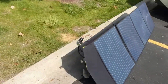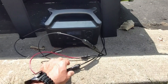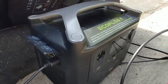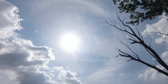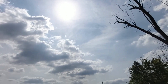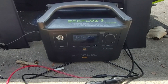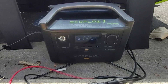I went ahead and plugged in the MC4 cables — the EcoFlow River Pro comes with MC4 cables that convert to an XT60 connector, about a four or five foot cable, and I have it connected into my power station. Right off the bat on this partly cloudy day, with the sun almost directly overhead, this solar panel gave me a consistent 142 watts. My power station is currently at 46% battery capacity, and at this rate the LCD shows it will be fully charged in just two hours.